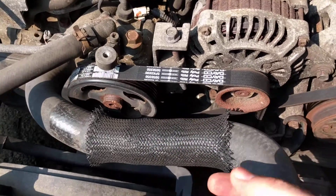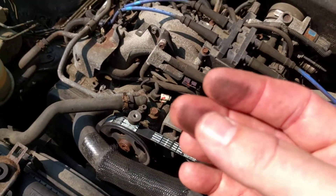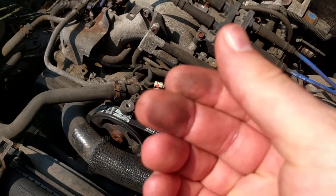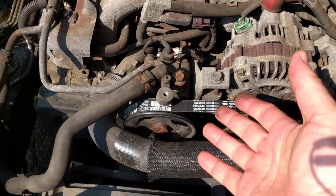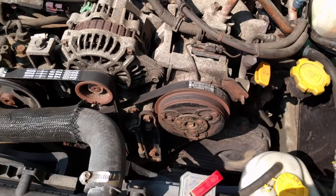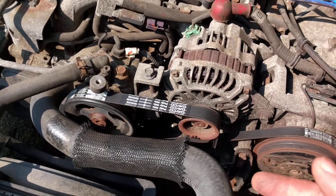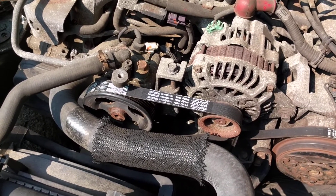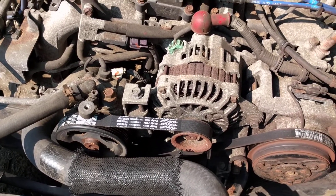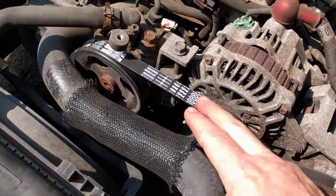You can just put your fingers under there to check — there is a little bit of residue here, but it's a dry powdery residue, which is just the rubber belt slowly disintegrating over time. Sometimes that dust itself could function as a lubricant, similar to graphite lubricant, but for the most part that is not the issue. Another cause of squealing is if the belts are loose.